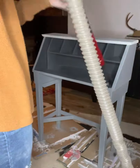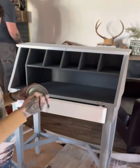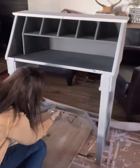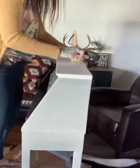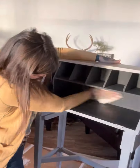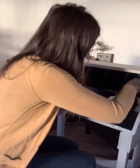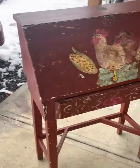Of course sanding paint causes a lot of dust, so I went over it with my vacuum — my son helped me out a little bit — and then of course wiped it down. Then I used Minwax Soft Touch Sealing Wax over the entire thing. I've had really good luck with this stuff. I've heard some people complain about the smell, but I've become nose blind to it so the smell doesn't bother me. I really like the durability of it. I used a wax brush to apply it but then went ahead and used a clean rag to get around the nooks and crannies.